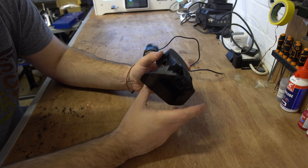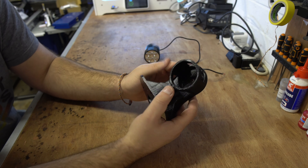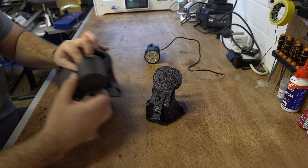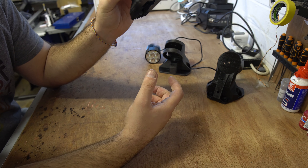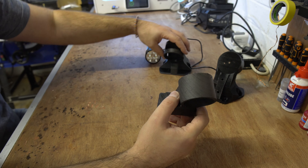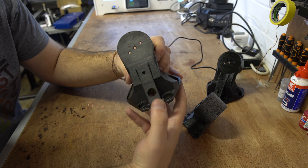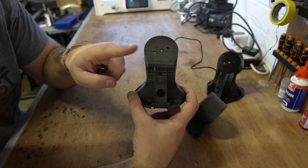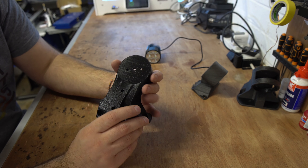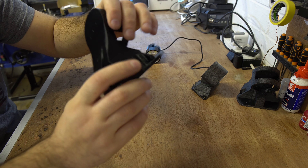This is what I came up with and I'm calling it Cyclops. It's a piece printed out of nylon and the printer's been going the last couple of days prototyping it. It isn't the first of its kind — I have an older nylon print and you can see the print quality is pretty poor on that one. That first one was too low and didn't see over the bars, so I scaled it up. Then I realized I'd made the hole for the switch too big — when the switch arrived it was smaller than the tech sheet said. Finally last night I printed this one overnight — nylon, 40% infill, three walls, pretty strong, complies ever so slightly but won't wobble around on the board.